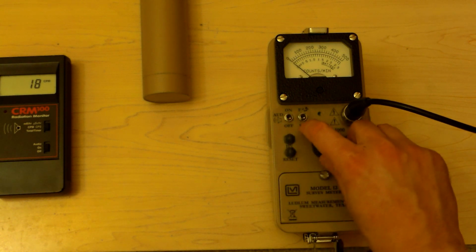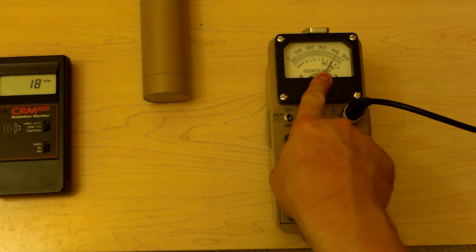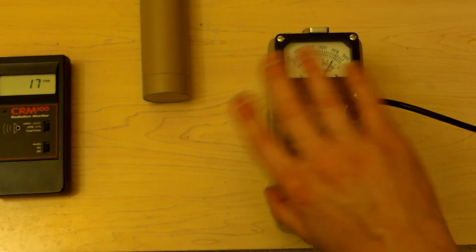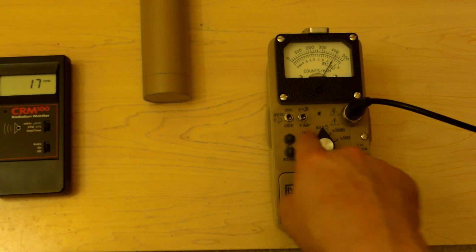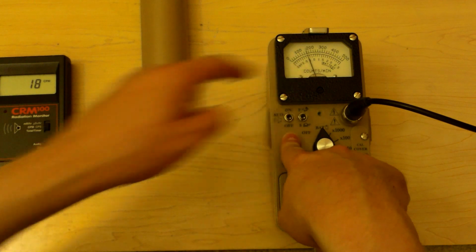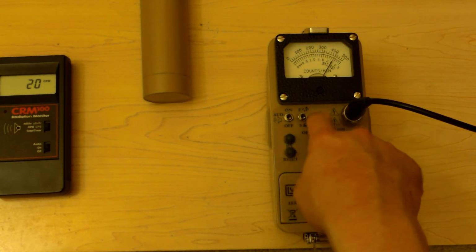And we're going to turn the detector onto battery. And you'll notice the battery's pretty good. Still right around the T on bat test. It's been that way since I got this thing, so apparently I'm not using too much power. We're going to hit the HV button, and that shows that we have about 800 volts of power, positive, which is good. That's what we want.